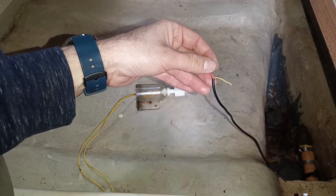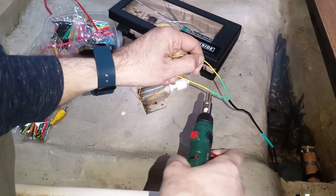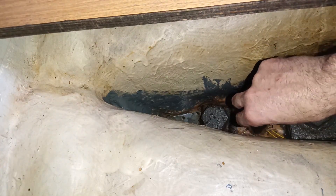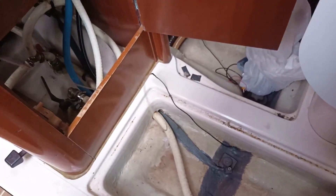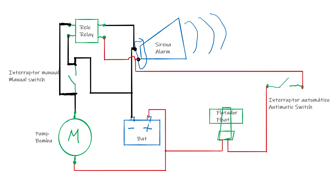For installation with float switches, we attach the float switch to the bilge with a bracket using epoxy resin. Be careful not to accidentally create a hole in the boat while installing the alarm. Extend the cables to a useful location — in my case, with considerable effort on an old boat, I ran them to the switch panel next to the bilge pump's manual start button. There I installed the relay and a switch in series with the float switch, so when water enters and the float rises, it closes the circuit and activates the relay. You can connect a small siren or a very loud one on the other side of the relay — this setup will alert you if you are on the boat.